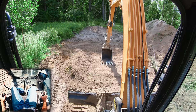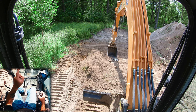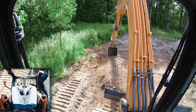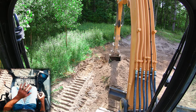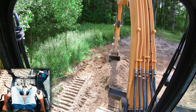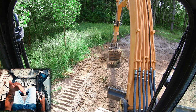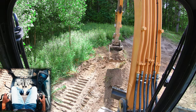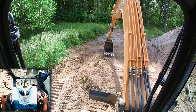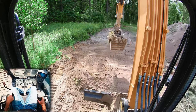Notice which direction that pile is facing and how it's oriented against the machine — it's oriented this way, not this way. The reason I'm doing that is because we've created a windrow I can use for resistance. I come in flat, nice and gentle, pulling into this until the pile starts to move. Instead of trying to whip in there with the stick, rotate back on the heel of the bucket. With that quick little stick flick, we're creating just enough oomph that the dirt falls back into the bucket — a pretty full bucket for what we're working with.